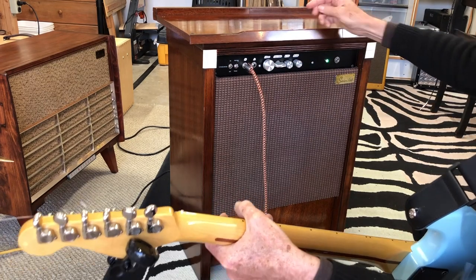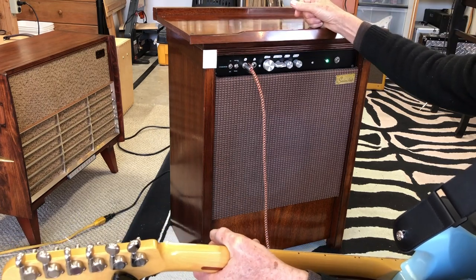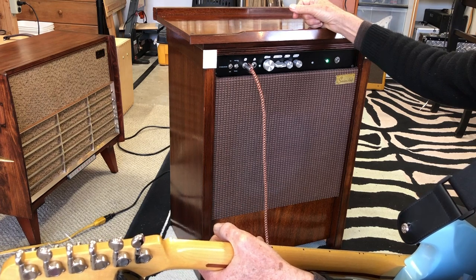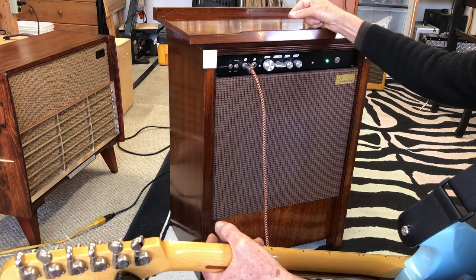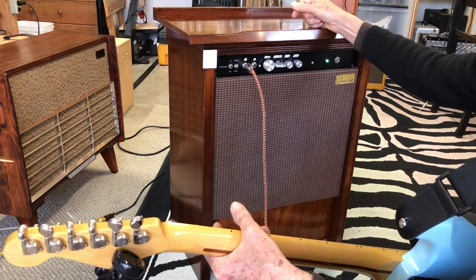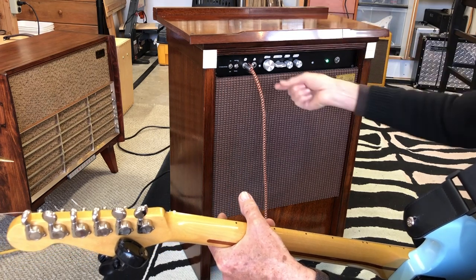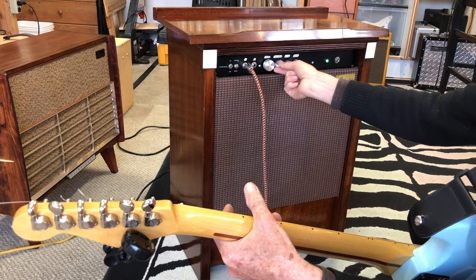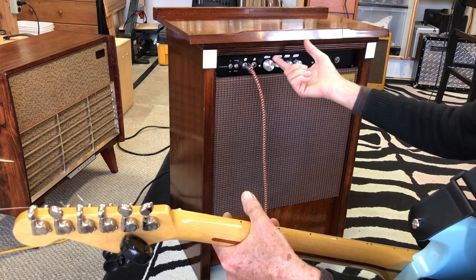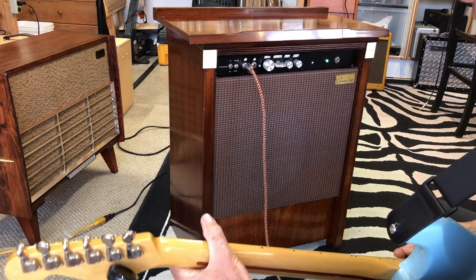And this was done because Vox came up with this in their amps because the EF86, being a pentode, usually needs a cathode follower stage and doesn't really like going straight into a tone stack because of impedance matching. But if you can get around that by having a filter switch with capacitors in it to roll off the top, it basically acts the same way without having to have all of that extra EQ going on. You also get a high cut here, which is quite effective.